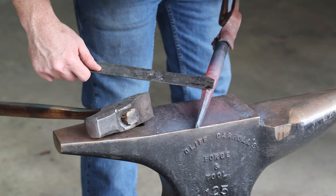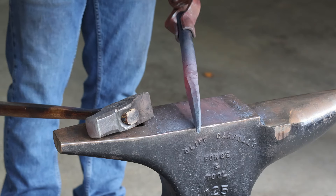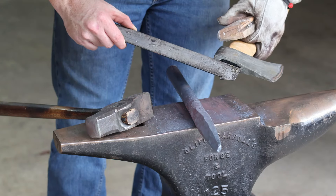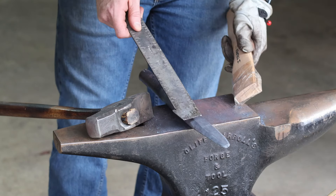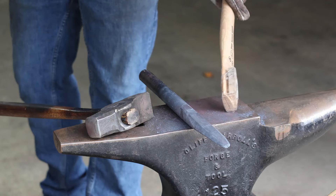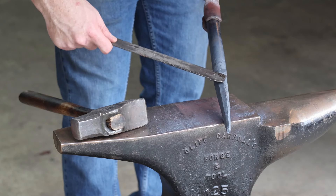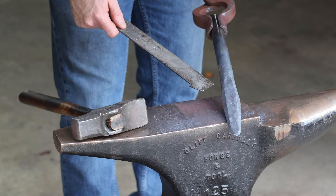That's about an inch and a half by five eighths, and unfortunately that's not as big as I want it to be. I found a handle that I've got that is two inches wide. I want it a little wider in order to fit the future handle better. So I think what I need to do is just forge this higher and higher until I get the width that I want and then shape the non-edged portion appropriately. I swapped to the rounding hammer in order to try to facilitate some more spreading.